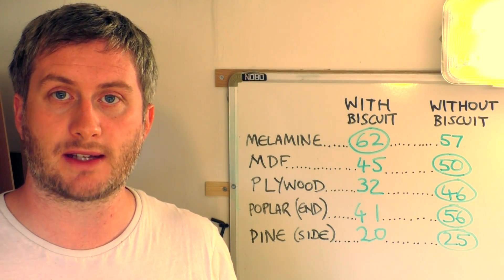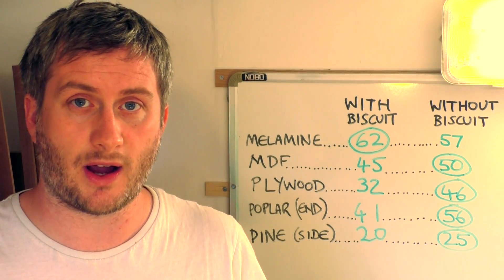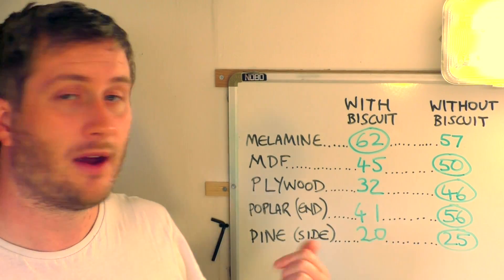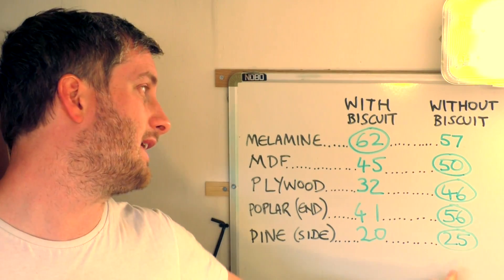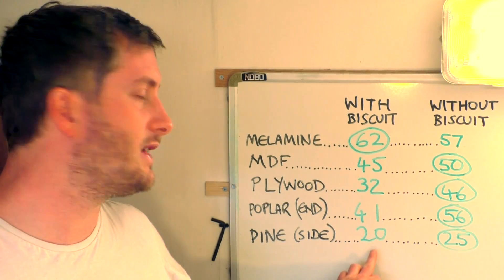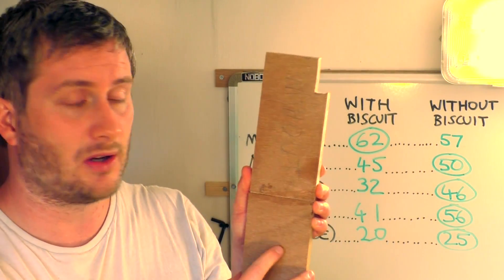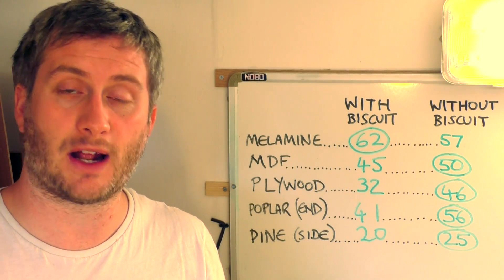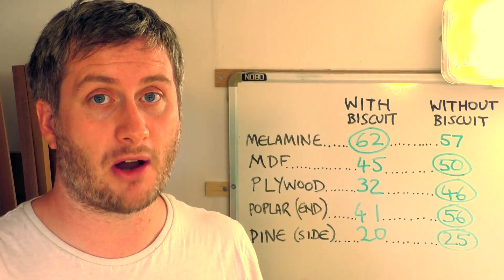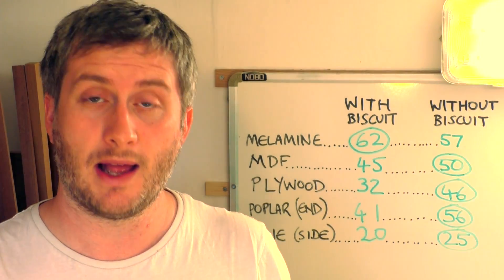So here are the results, and some of these really surprised me — although my experiment wasn't exactly scientific, so there may be some discrepancies involved. Biscuit joints aside, the most surprising thing was that the poplar end grain joints managed to withstand 56 kilograms of force without a biscuit. That's over twice as strong as the wood itself in the side grain glue up example. I had no idea that end grain joints could be that strong. I think the reason the side grain joints failed so badly is because of the width of the boards — if these boards had been wider there would have been far more strength in the wood. But even then I would still expect the wood to fail before the glue did, because modern wood glues are so strong, particularly on side grain joints. Do biscuits add strength? Well, according to my results, not at all. Five of the six joints were stronger without a biscuit than with. Are you as surprised about these results as I am? Let me know in the comments.